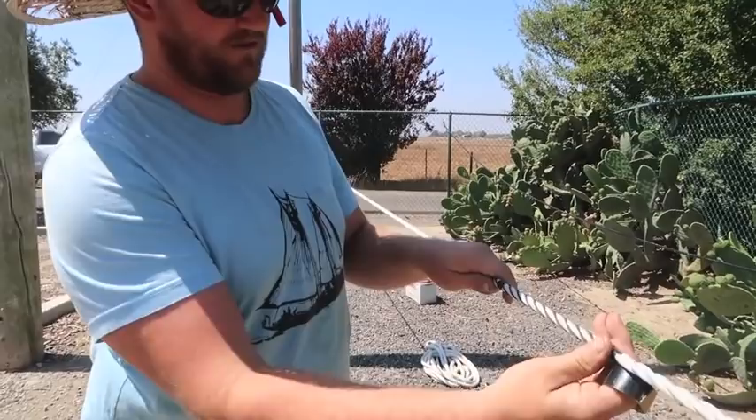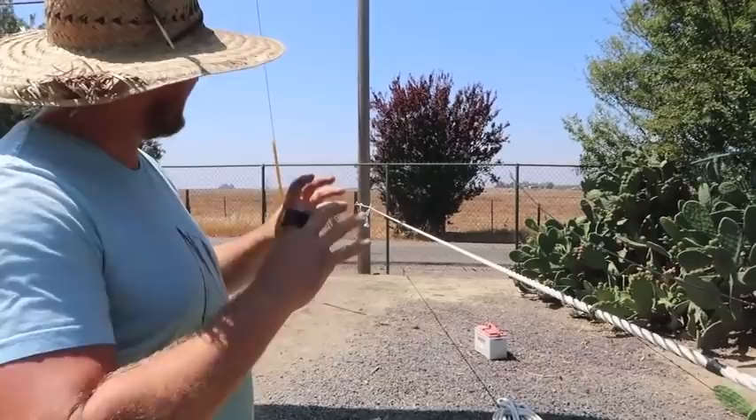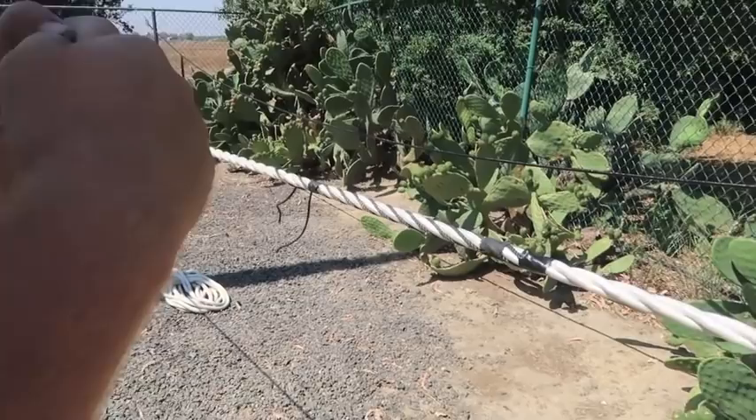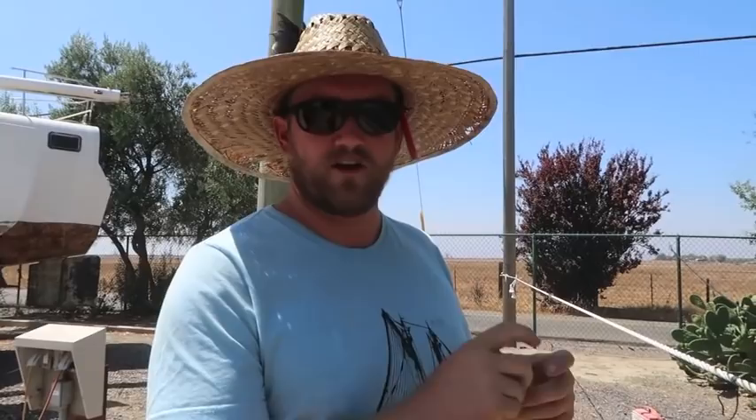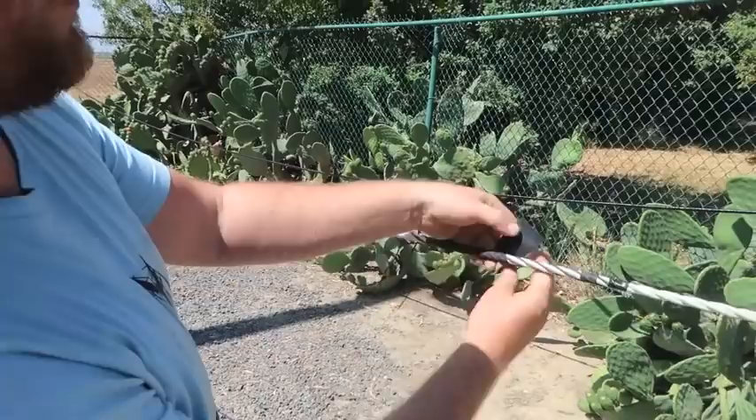Filling all the gaps is key. We're doing this just to make the part that will go around the thimble. But after that, once we get them spliced, we'll lay it out again and do this whole thing. This is one of the most important parts — I've measured exactly — because if I serve too much here, when I wrap it around the eye, I won't get a tight splice. I won't get a tight marriage at the base. Traditionally this part, you'd take canvas or cloth, whatever you had that would hold some tar, and dip it in tar and wrap it around the rig.